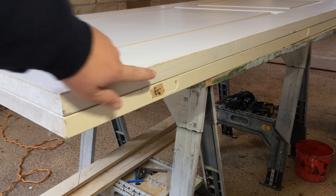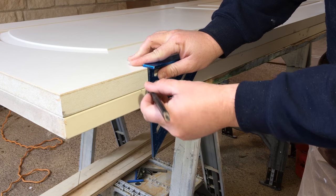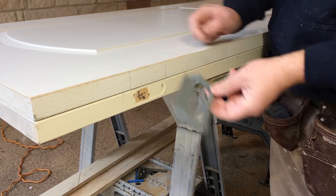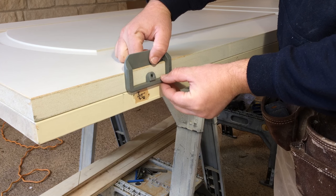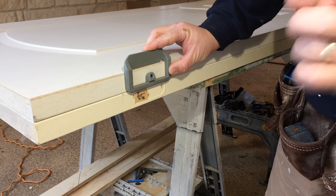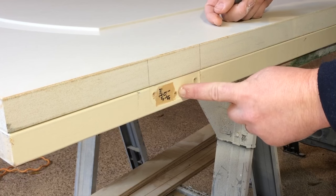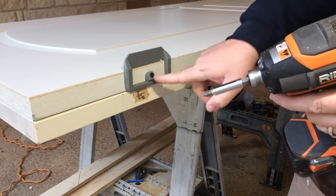Just line up the top edges and then trim the bottom once you get the hinges lined up. Take a square and line these up. Once you get your hinge marked, come in with your template — the template is marked for three and a half inch hinges. As far as I know, with every door I've ever hung it's always been three and a half. With a heavy-duty exterior security door it might be four inch hinges, but I don't run into that a lot with the residential work I do. You line that up, run a screw in, and see how that lines up with the screw hole — that's going to be the first hole for your hinge mortise.